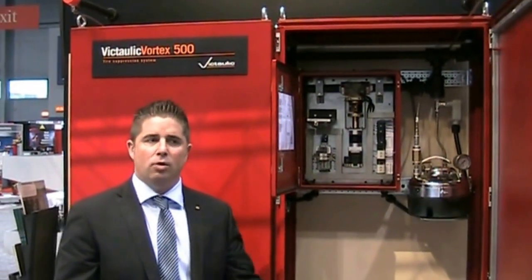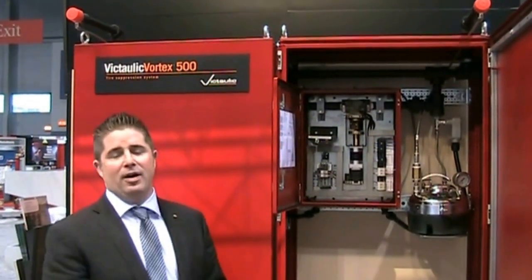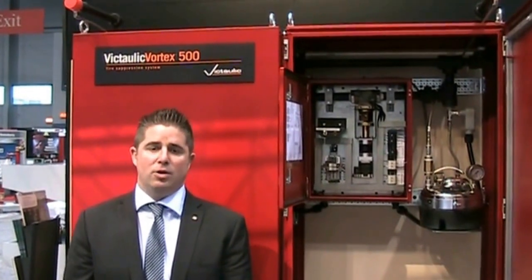When the cylinders are running low and it reads less than 25 psi of nitrogen flowing, we shut the water valve, open the drain valve, and just let nitrogen blow the rest of the water out. So we have a full nitrogen discharge at the end, again with no water.